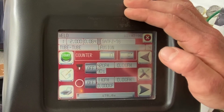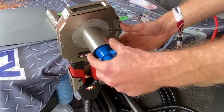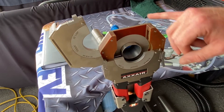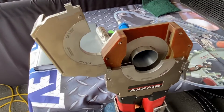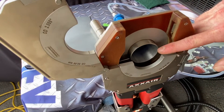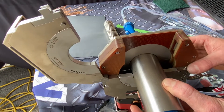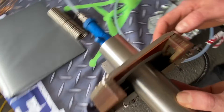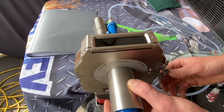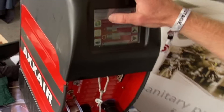Before I launch the program, I'm going to show you the weld head — how it looks and how we set it up. You can see we have a piece of tungsten that's going to be rotating around the tube during the weld. In one pass, 360 degrees, we're going to be able to weld. You'll notice burr-free, no bevel. For the fit-up, I'm just going to put the two pieces, butt them up one against each other, check the alignment with the tungsten. Once I'm all set, I can close this flap, lock this, and back at the power supply I can start the welding cycle.